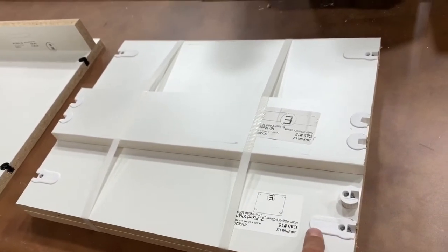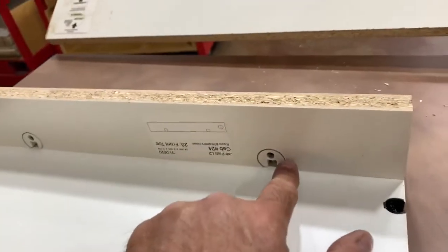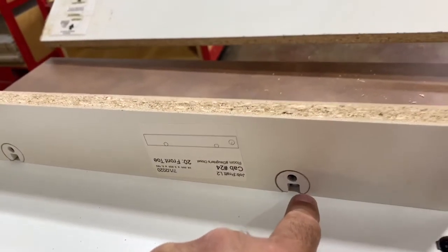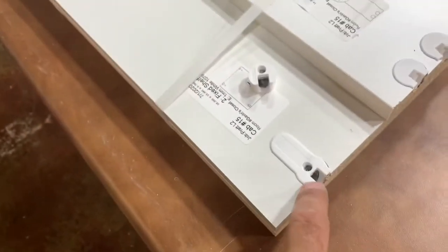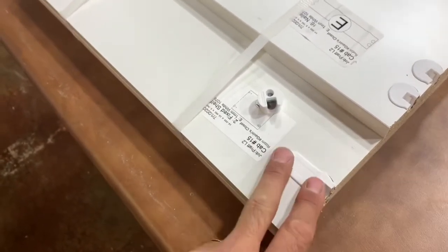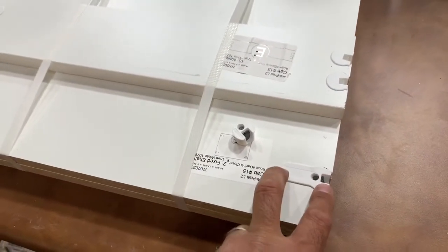I've got tooling on the bench we just haven't put in yet. We still use the countersink 20mm bit for that one. The 10mm hole is just straight in. I've got a 10mm bit with a countersink on it that we're going to install. We found that the countersink really eases installation — it lines up and taps in nice and easy — so we're hoping to get the same thing with the 10mm, that the lineup will go in much easier.